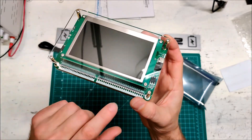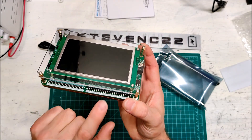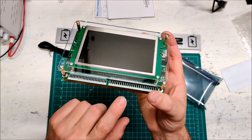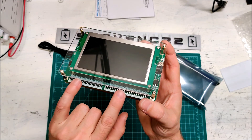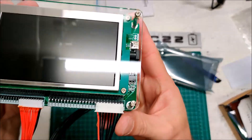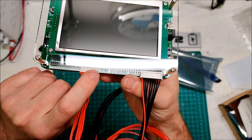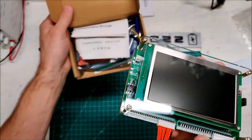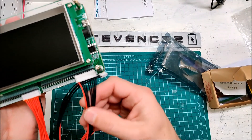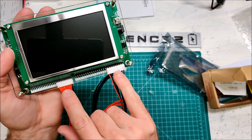I haven't confirmed what size pitches these are yet — I'm assuming this is the smaller pitch used by BMSs and this is the larger pitch used by RC chargers. I'll grab a couple of wires to check. Good news: I was right about the pitches. This is the smaller pitch used by BMSs — here's a DALY BMS balance wire confirming that — and this is the larger pitch used by RC chargers, confirmed by a balance lead I have in stock. So this does support the two different pitches.